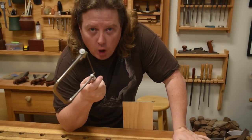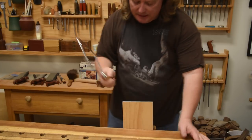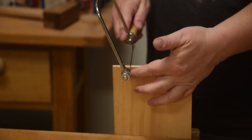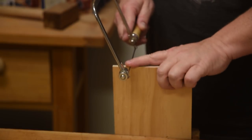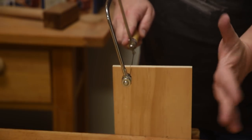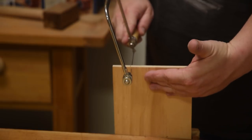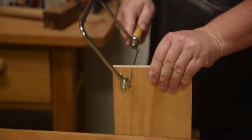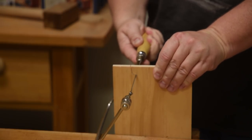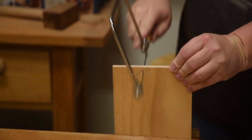The thing about these saws is you can only turn them if you are in motion — theoretically. The idea is, if you want to start cutting, I will sometimes put my finger on top to balance it. That way I know I'm not going to hurt myself on the cutting edge, and I can also stabilize it in a still spot to get it going. If you don't have your hand on the board, the board is going to vibrate and you're not going to cut very well. If you pull your hand back so you put the board in tension, the blade will actually cut a lot quicker. As long as the blade is moving, you can turn it — you cannot turn it and then move, it will bind up on you. You've got to keep the blade moving in order to cut circles or curves.